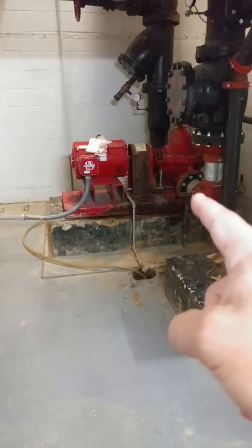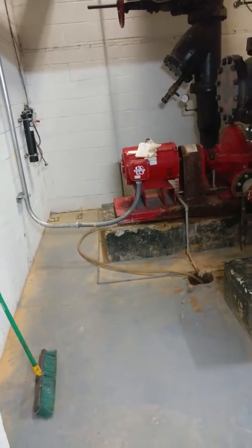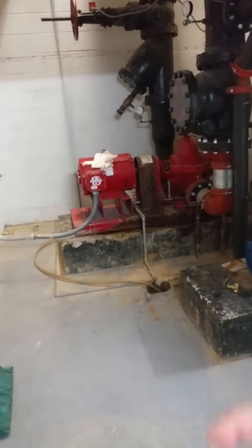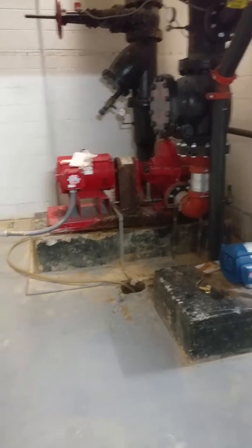I'm at Tyson's and they have this big fire system and it has two drains off of it. They come down here, one comes this way and one comes this way. These two drains, this is just temporary. So the bottom of this, there's a floor drain, there's a trap. The bottom of the trap has got a hole in it, and the camera goes straight out. So when they're snaking it or jetting it, they're going right out of the pipe — so stop doing that.